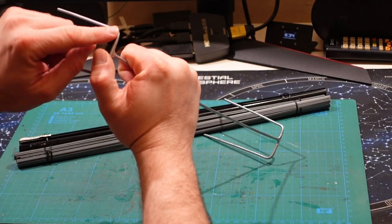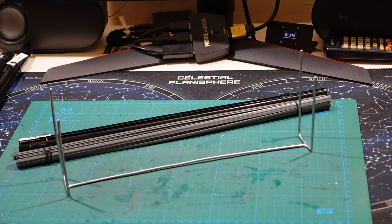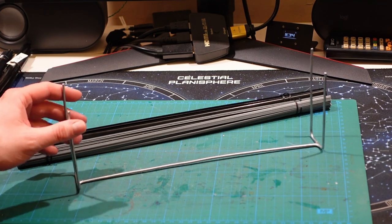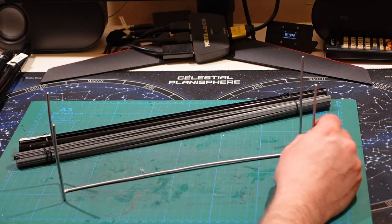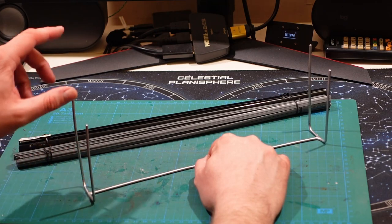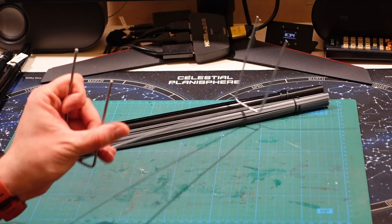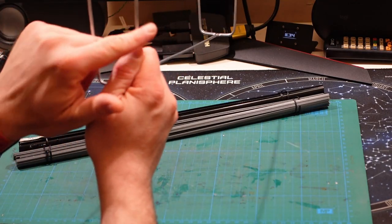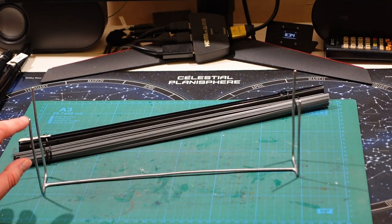When I was cutting this wire, instead of cutting 24 centimeters - 10, 10 and 4 - I knew that when you bend stuff with any width to it you will have a bend radius, and there is actual math for this. I believe Olde Tonic has a video exactly about this. I just added two more centimeters so cut 26cm pieces for both U-ends. I was mostly concerned about getting the 4 centimeters right, which I got, and was left with one end sticking a bit more - but I decided that's actually fine, now you have a left side and a right side.